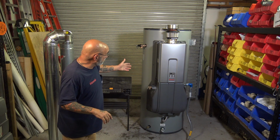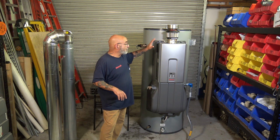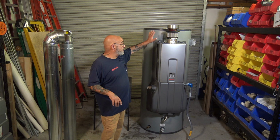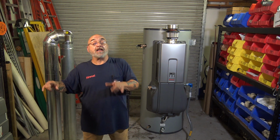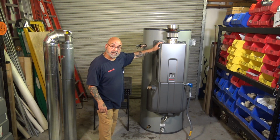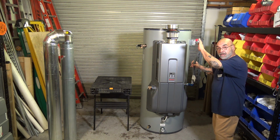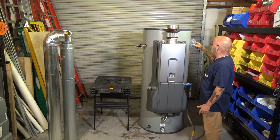So, to go over this briefly, this is, like I said, the new CHS199. It has a modified RL94, so it's an RLR94. Again, this unit can only be used in this application with the tank. If you get one, you cannot put it in a house, and you can't put an RL on this. It's a 119-gallon storage tank, 199,000 BTUs. Remember from the other video, it's got the pump and the controller and the sensors. 360-degree, 36-inch door mount gas flex. It has a power box that you bring power to, you plug the pump into, and you can plug in an accessory.